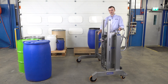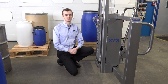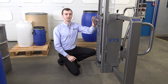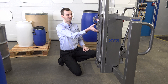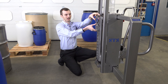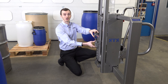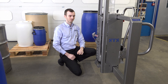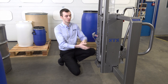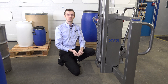We'll now adjust our gripper because we're going to be handling this Mauser drum. At the front of the unit where our catch is situated, we can adjust it to handle different drum types. The first adjustment is for height — to adjust the height we hold the base of the catch with one hand and remove the securing pin located here. We then unhook the gripper by tilting it backwards and it becomes completely free within the channel. We can raise or lower the catch depending on the height of drum we need to lift, then hook it back into position. Because we're going to be handling a tall drum we move it back into a high position, lift it up, and socket it in place. Once happy with the height we refit the securing pin.